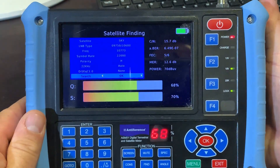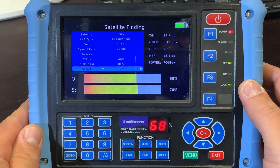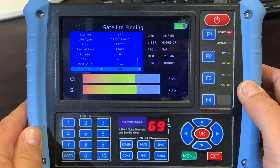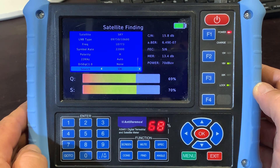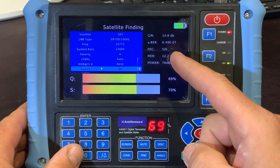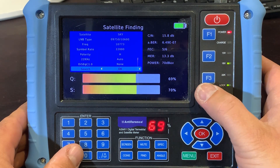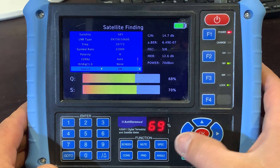So we're going to connect in to the antenna and LNB input. Here's what I made earlier — my dish is in fact already aligned because I'm just connecting to an existing installation. You'll now see that we've got a lock-on on the satellite, and we can see that we've got reasonable signal strength and quality. Once we've locked on to the satellite, we can see the carrier-to-noise readout, bit error rates, FEC, and MER, which tells us about the quality and the actual signal level coming in.